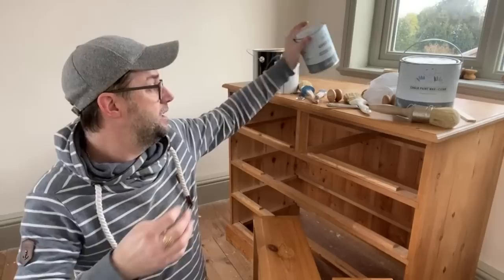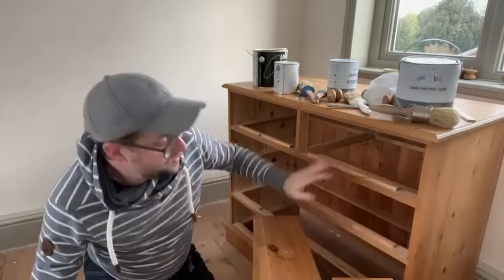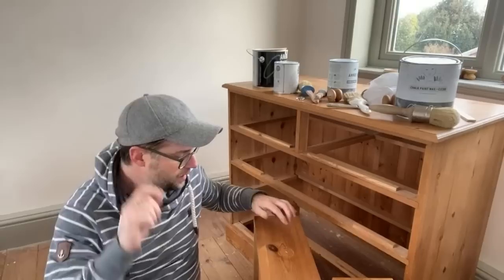Let me talk a bit about prep work for a beginner creating a simple flat finish. I've given the piece a good clean — that's one important step. Taking away any debris, anything in the drawers, anything that might contaminate your paint finish. You could use mineral spirits or other good grime cutters to remove anything greasy. Greasy is not good — wax is fine. Once you've done that, you're good to go: simply brush on and off you go.